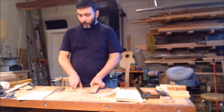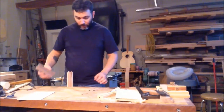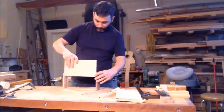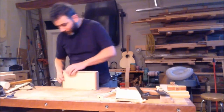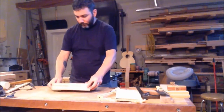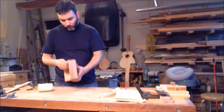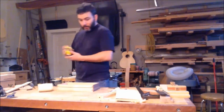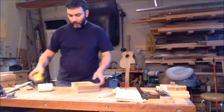I just finished all the parts for the first drawer, so we're going to do a dry fit and see how it fits inside the toolbox. I'm going to put all the sides together — I've got this little piece that's going to make the bottom — and then this one goes on the other side. Now we can check for square: twelve and nine-sixteenths, twelve and nine-sixteenths — so I'm already square.